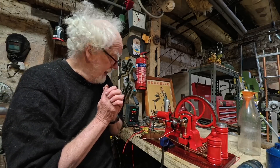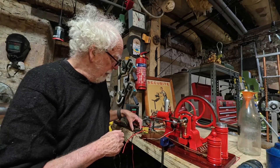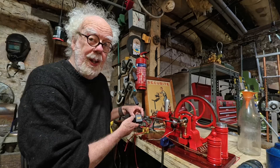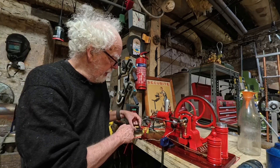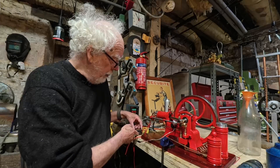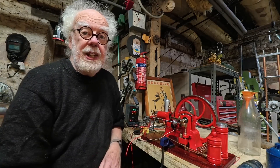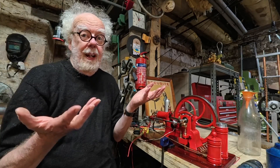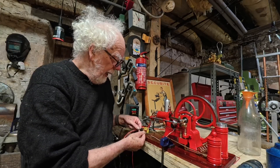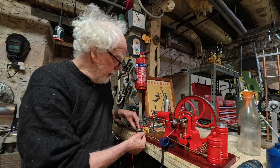What I discovered were two very strange things. First, these Musa power supplies — the boxes that come with the kit — only work if they're facing upwards with the Musa label facing up. If you have it upside down, which is easy to do just resting on the bench, mine didn't work. Also, double-check that you've got the trigger wires the right way around — this one came with white, red, and black, matching the Musa ignition unit.